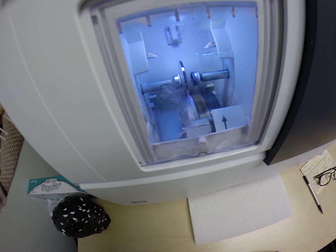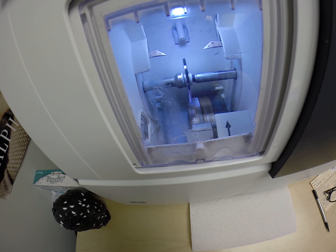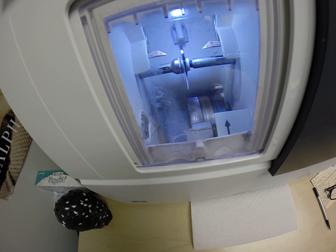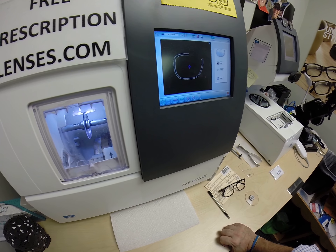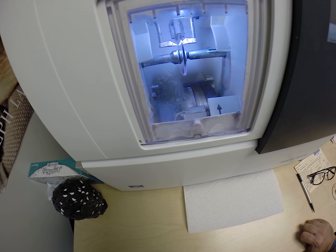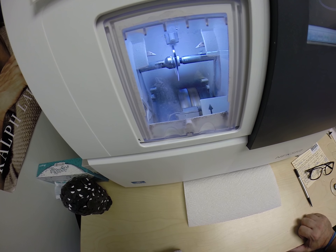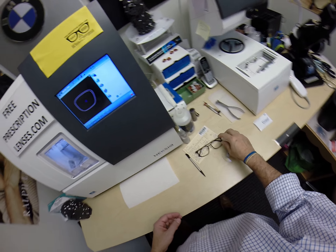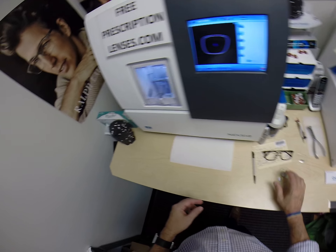Door is going to close, clamp is going to shut. Then the two wide styluses are going to trace the shape of the right side of the frame, again making sure it's large enough to fit. As the old carpenter said, measure twice cut once. It's measuring the thickness of the lens at every point to know exactly and precisely where to place the bevel so you have the least amount of edge thickness showing, of which you will hardly have any in this frame with your prescription because of the polycarbonate lenses.